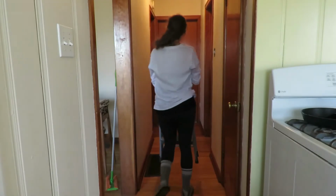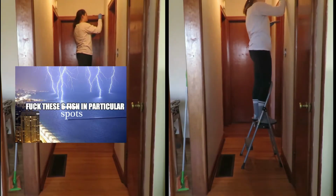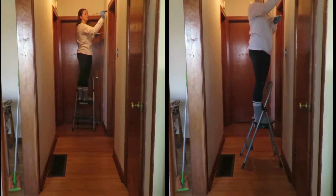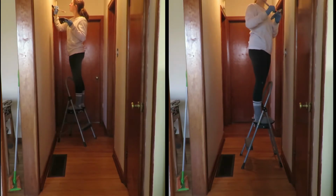When I was sanding, I did find that there were some cracks that were visibly textured ridges, so I sanded those down too. And since sanding them down entered a new color into my workspace, I need to prime only those spots, those 6 spots in particular. I simply use the paint lid as my palette because when you mix it back and forth, some of the paint gets onto the paint lid, and might as well get a smaller area rather than bringing the entire palette with you because I wasn't needing that much paint anyways.